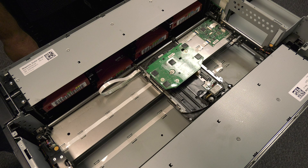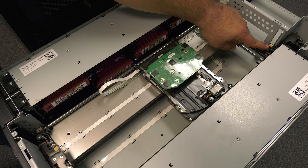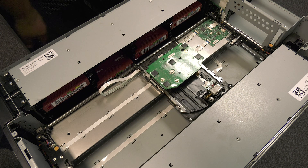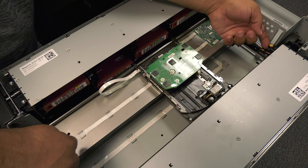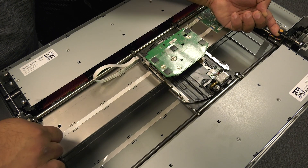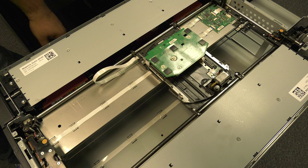To lift the picker out, you will need to find the two points on the picker that have an orange sticker. Most of the time this sticker will also have text that says 'lift here' on it. Once you have located these two points, gently lift up on the picker and it should glide up the tracks where you can lift it up to the top. If your picker is stuck and not gliding up the tracks, do not force it — open a ticket through the Rocket Plus customer portal and we will be happy to assist you.